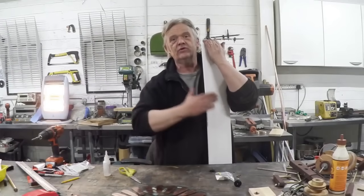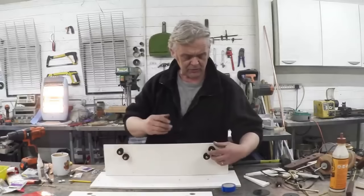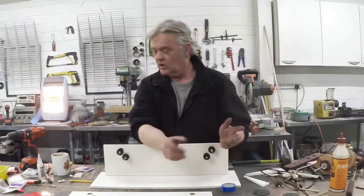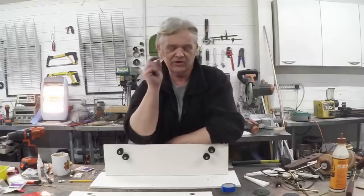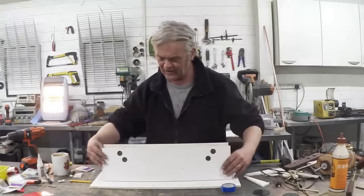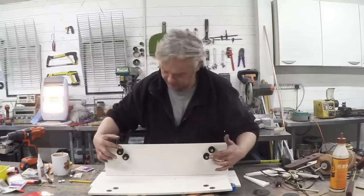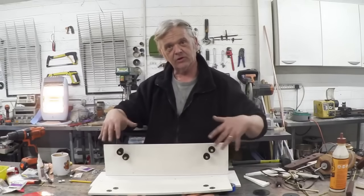The cradle is just a couple of bits of builder's board with some bearings in it — skater bearings — and a little pulley section. The spacers are 8mm plumbing olives with 8mm washers to make sure the 8mm pulleys all line up. I've offset the pulleys so that one pair is further one way and the other pair the other way, meaning the two glass discs will be separate but resting each on their own pulleys.